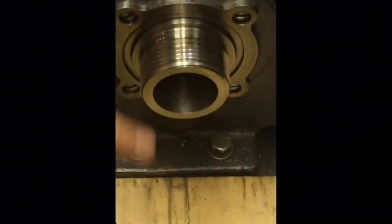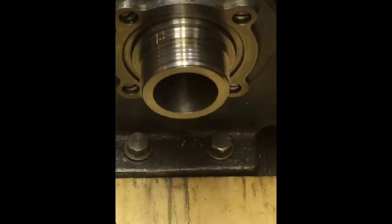And that falls right in between the maximum and minimum pitch diameters for a 2A. Max is 2.1664, and the minimum is 2.1584. So 163, it's right in the middle. So we're going to shoot for that when we make the external thread plug gauge. I had all this info written down here out of the Machinery's Handbook.